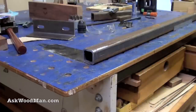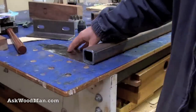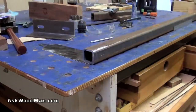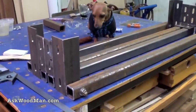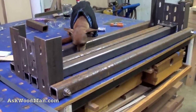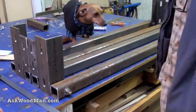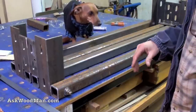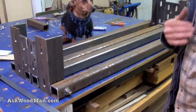So now I'll just peen that and drill it out and it'll make sure that bolt is going to go through there exactly right. This thickness here — it's about half a millimeter difference — but it just takes a second to do it right. All right, I've got all my steel pieces bolted together. I don't have them tightened down yet, but I just wanted to show you why it's so important to do the little bounding jig I made to mark all your pieces so you can drill accurately. I'm going to do this in one shot so you know I'm not joshing you. I apologize for talking with something in my mouth, but I have a sore throat and a lozenge to help me talk.